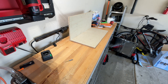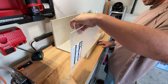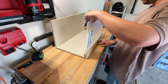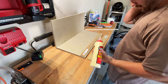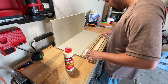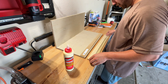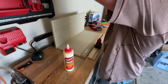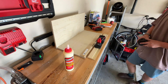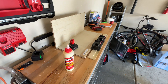Somehow I missed this, but I took those two pieces of plywood and basically screwed them together — I had to drill and add some screws. The idea is sandwiching three of those slats together so the polycarbonate can slide through there. At Lowe's I realized they were the same thickness, so I could use three of them to create a little track, which is kind of the simpler way to do stuff. I didn't have any clamps, so I used my batteries to clamp it down.